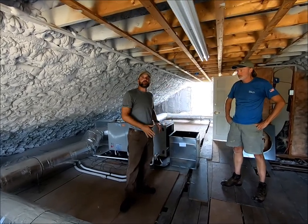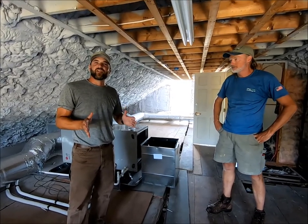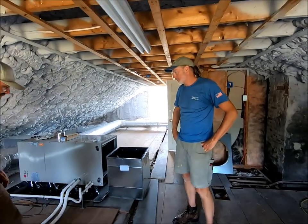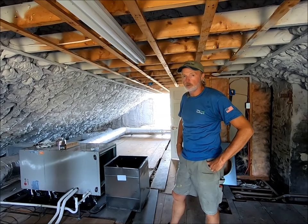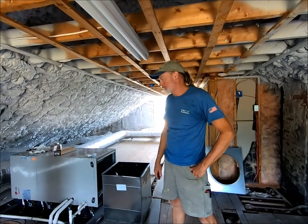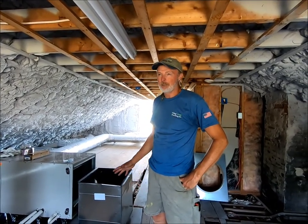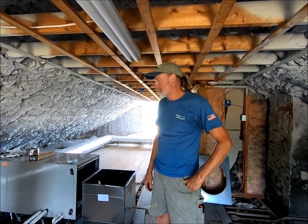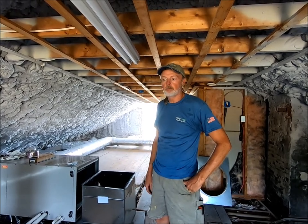I'm here with Bill Battles from Village Plumbing here in Westport. Bill is handling our plumbing and HVAC here at the Kirby House build. Bill, why don't you tell us a little bit about what you're working on? At the Kirby House we've got two 3.5 ton heat pump systems to do the heating, cooling, and dehumidification for the project. The heat pump will take care of the heating load technically down to minus 13 degrees at probably about 85 percent capacity. To back that up on really cold days, it has electric resistance heat in there to help offset the heat pump on really chilly days.